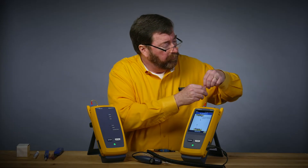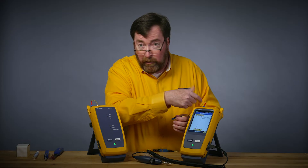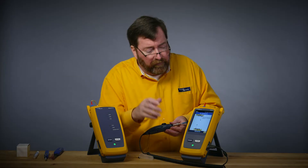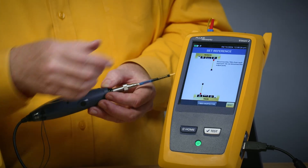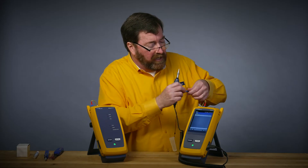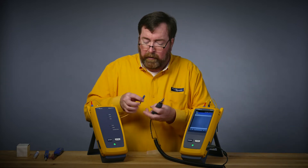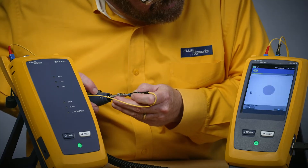Now we do need to plug in the other leg. In the other leg, even though there seem to be two ferrules here, we're only using one of the fibers — the other fiber is on our transmit leg. So I just need to inspect the one fiber that's next to the key to make sure that that's good. Here is a fun enhancement in the 6.12 firmware — you'll notice now there's a fiber inspector button. So if you forget about the secret button, I can inspect this in the middle of the set reference wizard without having to jump out of the wizard. I'm going to have the black key going towards the right. I'm just inspecting the one fiber because there's nothing on the other leg.